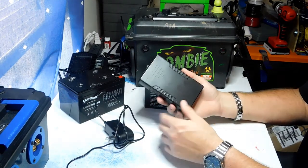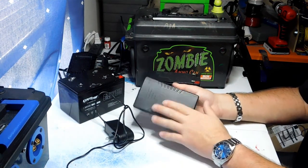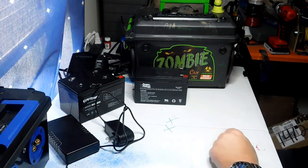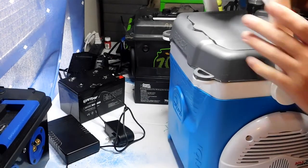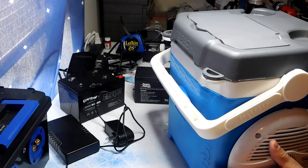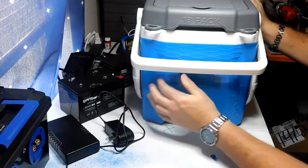The difference is this lithium-ion is only going to put out about three amps, so you can't power a car radio with it. But if you just have a Bluetooth circuit with FM, it will work just fine. Let me show you my cooler build to illustrate that.